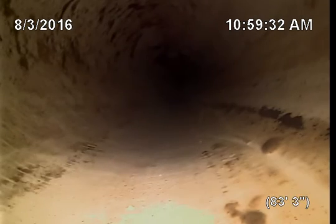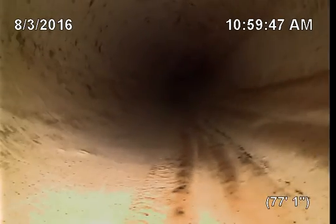The next problem we're going to see is Orangeburg. Orangeburg is paper pipe. I don't know why when they replaced this pipe and did a repair they didn't take all that out. But they didn't. But it's way back. As you can see, 80-some feet, no problem. This pipe has been flushed and used decently recently, and there's no water sitting in it, like there is on the other side.